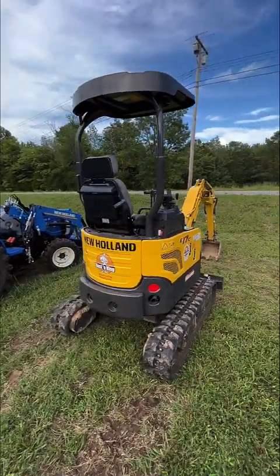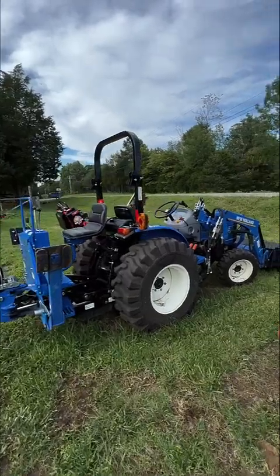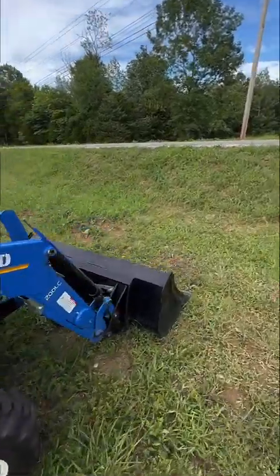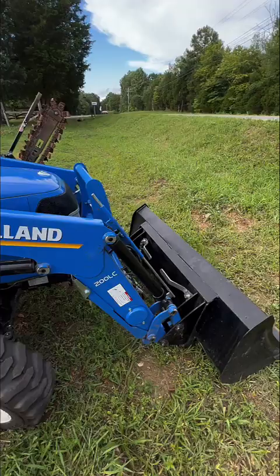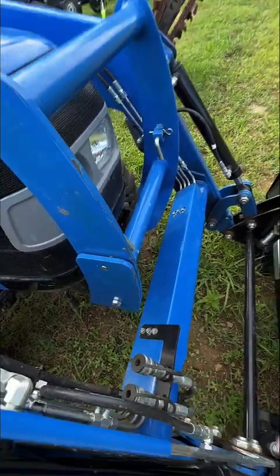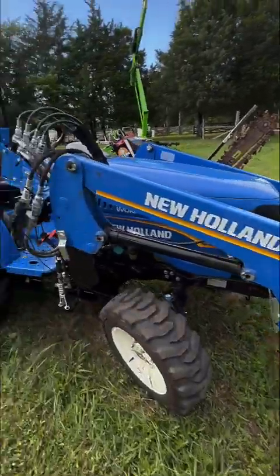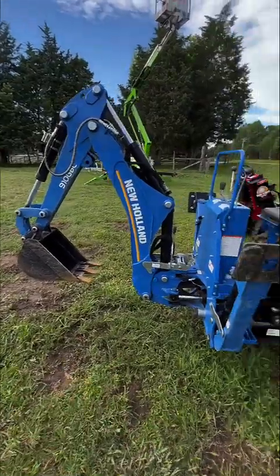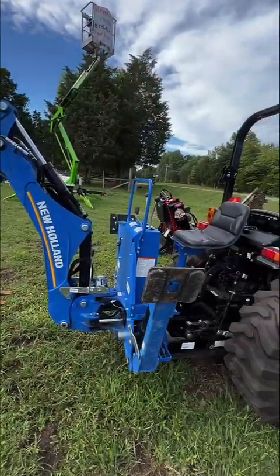Now, like I said, I love the tractor — I absolutely love this tractor. You've got the bucket, you've got quick release, quick attach. So I can go from this bucket, just by pulling this lever, and switch over to the grapple. I have to plug in here — I have to know that those hoses go in here. But two levers, two hoses, boom — I go from the bucket hauling dirt or gravel to the grapple. And if I'm digging out bushes, this is a great tool for that, because I can take the backhoe, dig out the bush, set it to the side, turn around, use my grapple, come back, grab it, and go throw it up on the burn pile. Very effective for that.